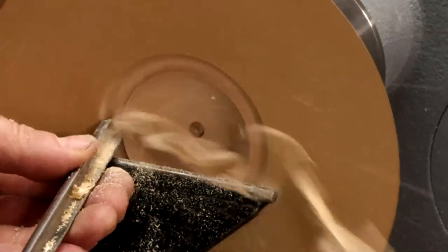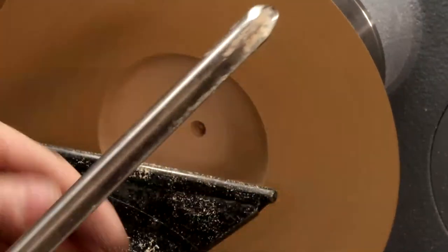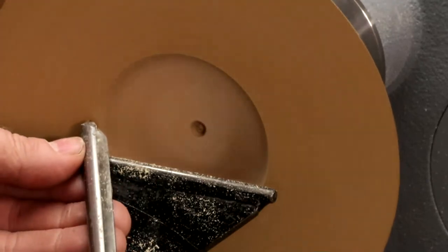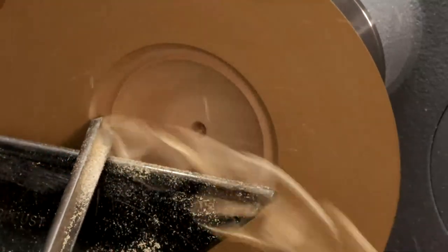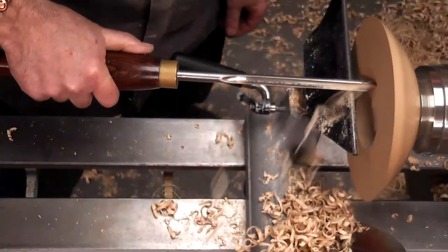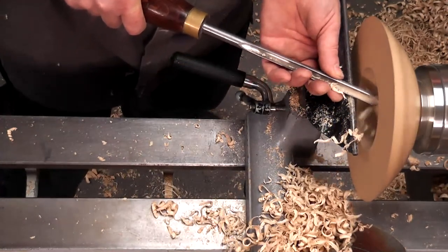I don't want to go too deep with this. So back to that grip again. Finger and thumb. Bevel angle. Lined up where we want to go. We're about 2 o'clock. My left thumb pushes forward a little bit. Now I can relax. I've created a wall. It's sat inside. We can drive our gouge. So my left hand's right out of the way at this point. Gently driving around. So I can rest on that bevel. Go all the way. But my handle's traveling.